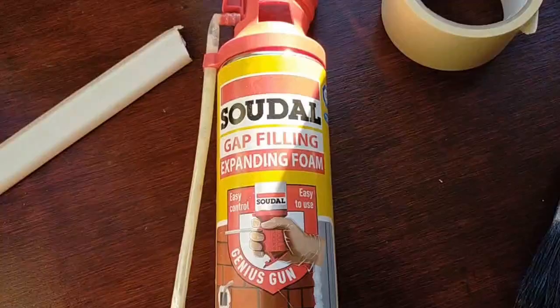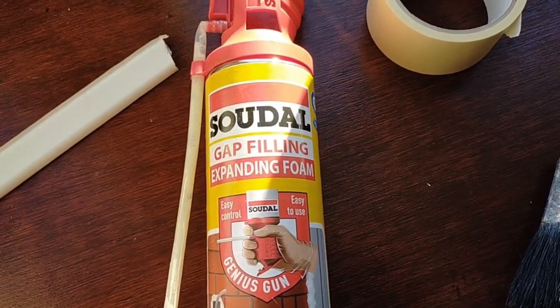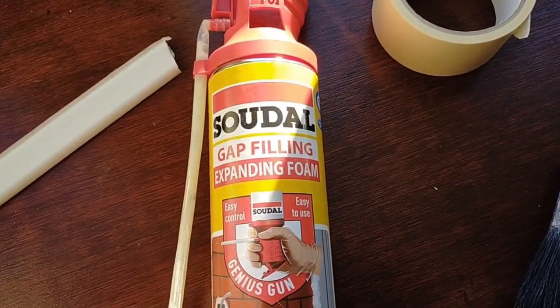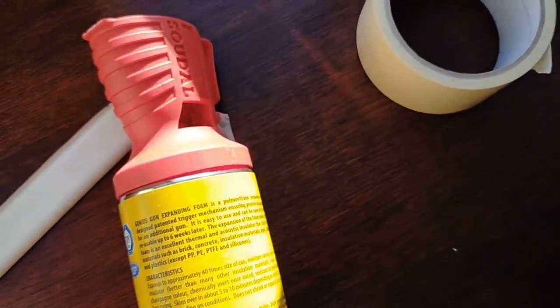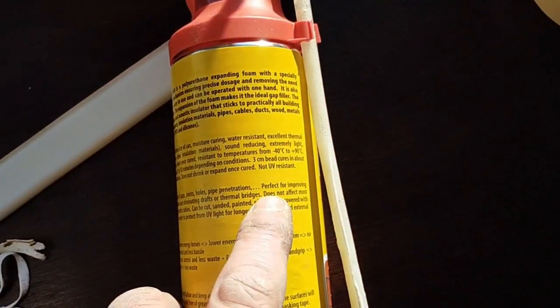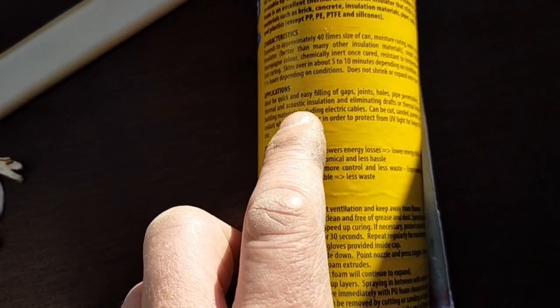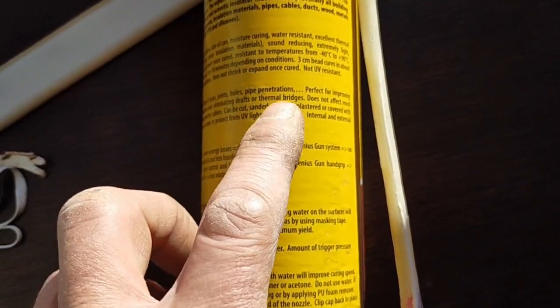It's never able to warm up. So this is what I'm going to be using to fill that gap. This is a good all-rounder serial gap-filling foam — it's got good bond strength and acoustic and thermal properties. It's perfect for thermal and acoustic insulation and eliminating drafts or thermal bridges, as in cold surfaces.